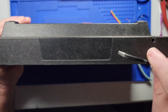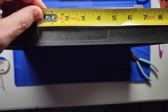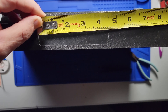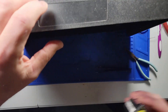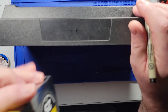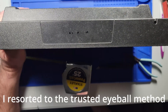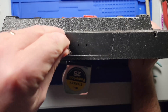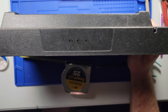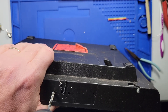I plan on installing my jacks in this area and centering them in that space. The case is four and a half inches wide, so half of that is two and a quarter inches. I'll place a mark at the two and one-quarter inch mark in both directions. I think those points are pretty close to being equal distance apart, giving plenty of space. Then I'll go get my drill and get after it.